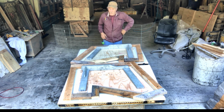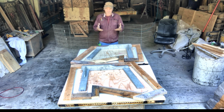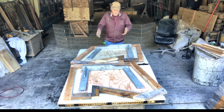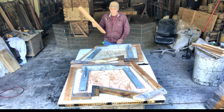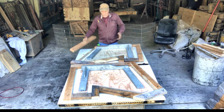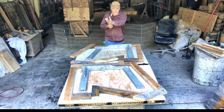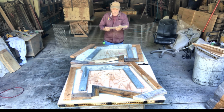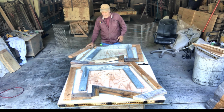All right, I got all the prototype pieces cut, and right now I've got to prepare the pieces so that I can actually use the rubber and the cement and not have either stick to any of this. The forms that I put on last are for the concrete. They're really going to be discarded right now until the rubber's done. But I got it all cut nevertheless. On these rubber stops, or the forms for the rubbers, I've taped these to where the rubber can't stick to it. It's a plastic tape and it ain't going to stick. So as we release this, it'll get some release on here, but it doesn't need it. So right now the forms, this one's going to be oiled prior to the cement, and these are already taped.